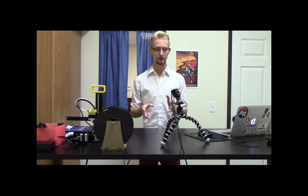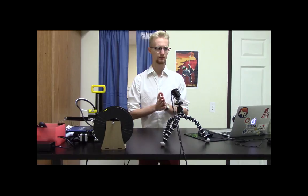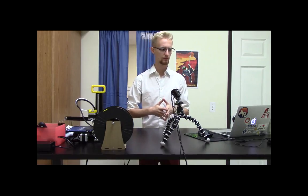What we're going to do now is either install the 15.04.6 that is on the SD cards that came with your packs, or you can download the 2.6.2 that is online at Cura right now. Do you guys have a preference of which one we do? Okay, if we're going to download the one from online, it's much more updated and it is pretty easy to use. If you just type Cura into a Google search, it should be the first one at the top of the page, and we're going to download Cura 2.6.2.